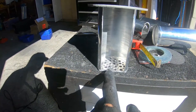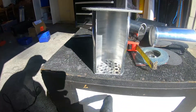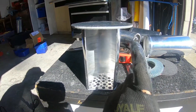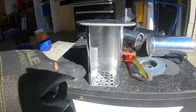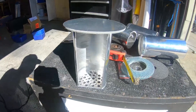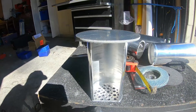The reason I put this little bottom piece with holes in it is I'm gonna loosely fill it with some steel wool, which will hopefully catch a lot of the crap before it drips into the can. The filters will be roughly on the side of the can. After doing some research, the main reason for a baffle is just to stop oil from blowing straight up. So this is my version of the baffle — you won't see any of this once it's in the can. Oil will drop down into the main can and air will come out.